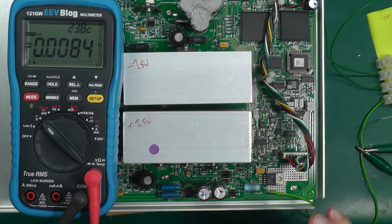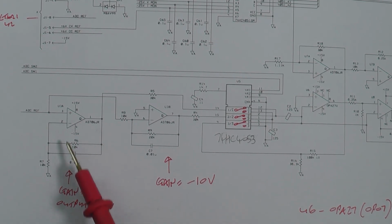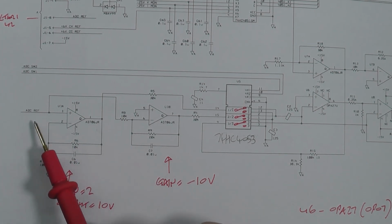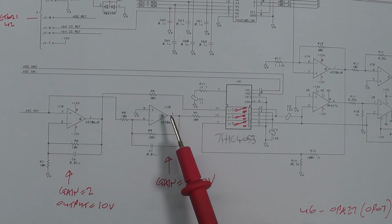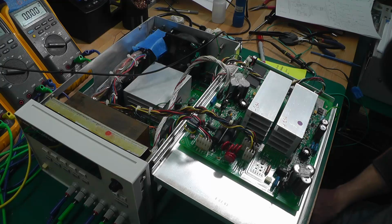So once the power supply is up and running, I will change them out, because I think they should be precision resistors, definitely, because it's a reference circuit. So there it is, the 4 resistors I changed out, and I had plus 10 volts there and minus 10 volts there. Perfect. Well, I think that about wraps it up for the first video.